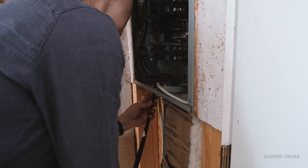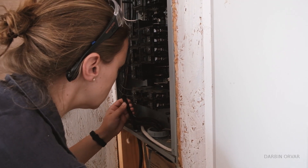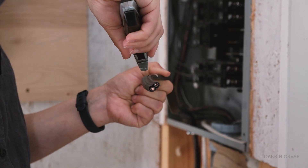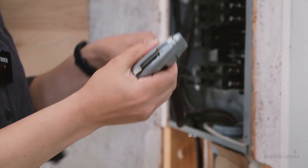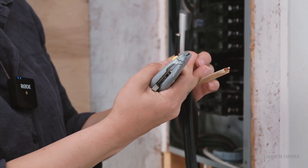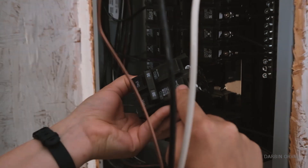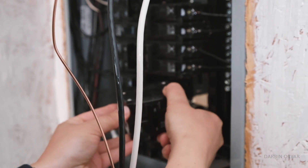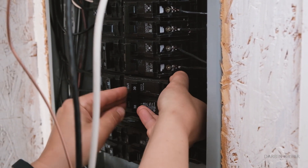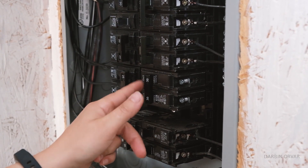Let's see how much wire we actually need here — I'm going to feed this up here. This wire is pretty thick, so that's why it's nice to have a strain relief to hold everything in place. So we have one black and one white, but we're actually going to use both of these as hot. Right here we have the ground. This is a special breaker to get 240 volts, 30 amp. I'm going to hook it in there, find the spot, hook it in and then push it in. Currently you can see it says off and on, so it's set to off — and that's where you want it.